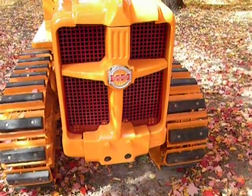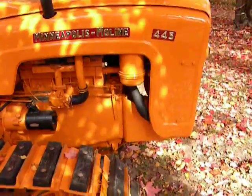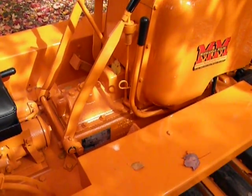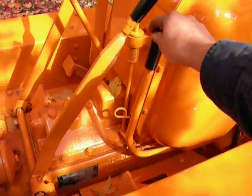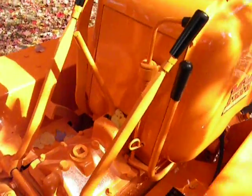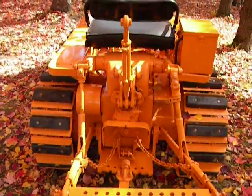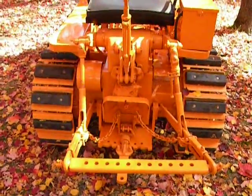It's got the standard 445 cross on the front and Moline emblem. All the sheet metal is the same; it's even got the 445 tag on it. The transmission is the shorter style 445 tractor production transmission that would have been found in a utility or industrial model. It's got the Minneapolis Moline Ampli-Torque high-low range unit in it. It's got the production 445 three-point lift assembly on it, a belt pulley, PTO — pretty much set up as an agricultural-based machine.